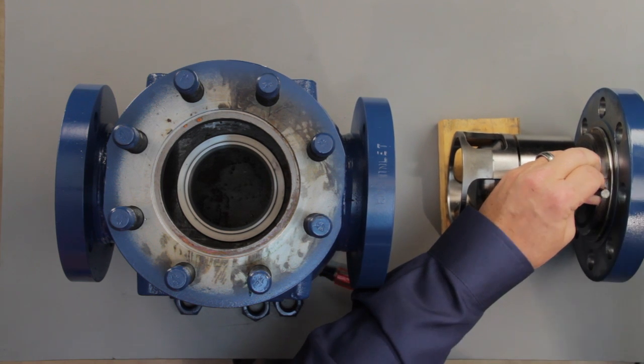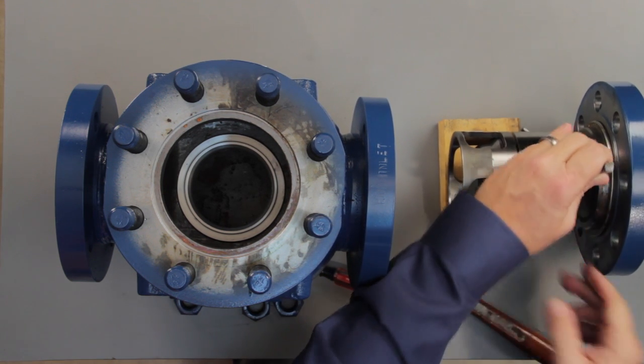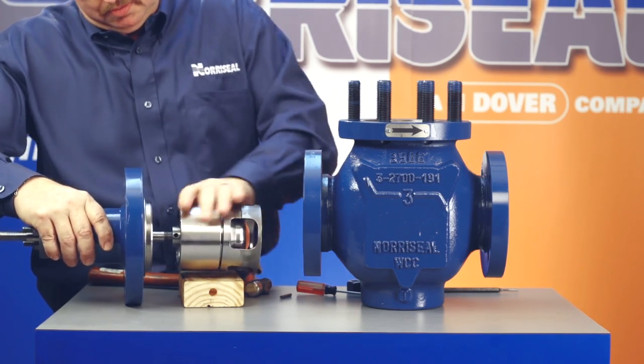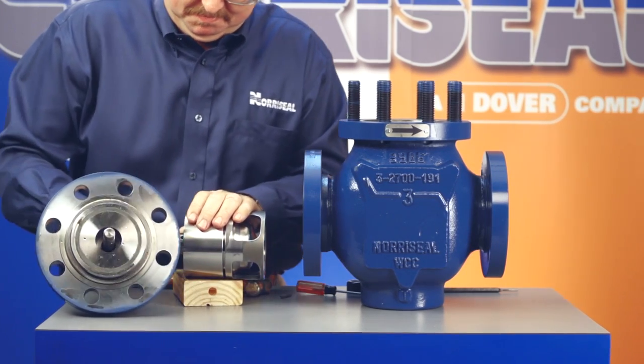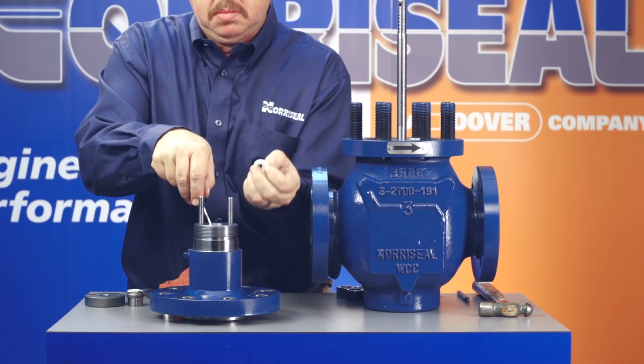Separate the plug from the stem by driving out the plug pin with a punch and turning the plug, cage, and guide counterclockwise. The plug pin is exposed and visible just above the guide. If the valve plug needs replacing, always replace the entire plug, plug pin, and stem assembly. If the diaphragm valve stem connector has been removed, the stem and trim assembly can be removed from the bonnet. Always replace the packing if the stem is removed from the valve bonnet. Loosen the packing retainer and remove the stem from the bonnet. Slide the plug out of the cage and guide and lift the seat ring and gasket out of the body.